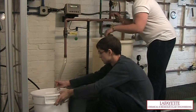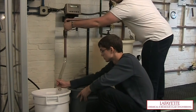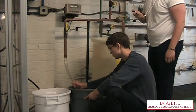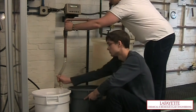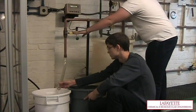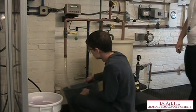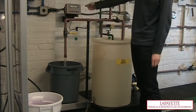Have one person simultaneously open V160 and close V161. Another person will wait until the flow rate steadies and then move the tube to the collection bucket. At the same time, the timer will begin to count down from 10 using the stopwatch. After 10 seconds, the exit tube will be removed from the collection bucket and moved back into the waste bucket. All the valves will be turned back to their starting position to stop the flow out of the tube. Mass the water collected over the 10 seconds in the collection bucket and pour the collected and waste water back into the feed supply tank.